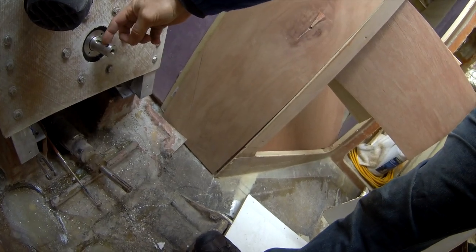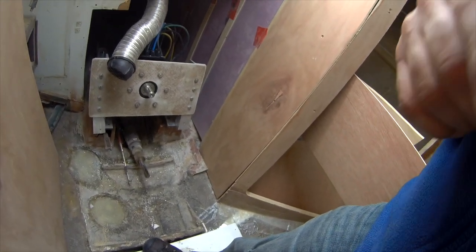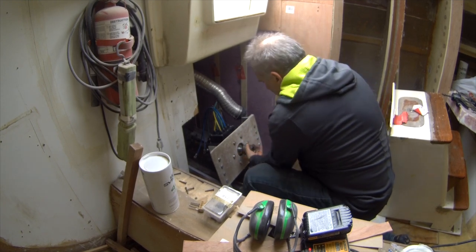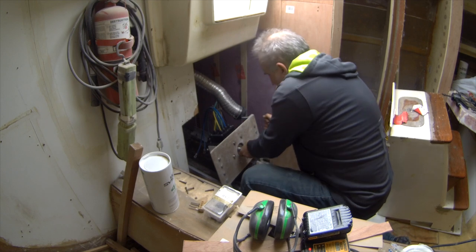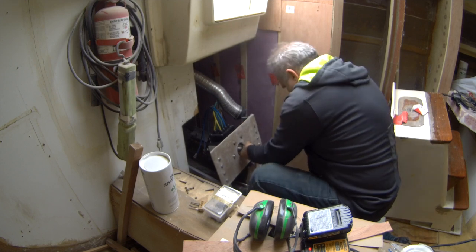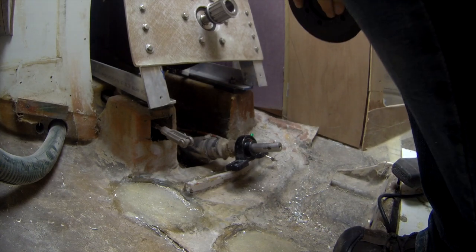I intended on putting the sleeve with the gear out and this one with the gear in, but we'll see how it works. Hopefully I don't need to align anything because I did a best guess. What it's doing is pulling the gear in tight — the taperedness of the bearing and the key are tight now — so basically snugging them in is slowly bringing it tighter on the shaft. That's good — done where I wanted it to fit.